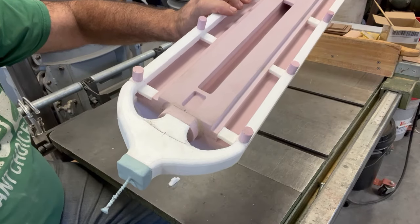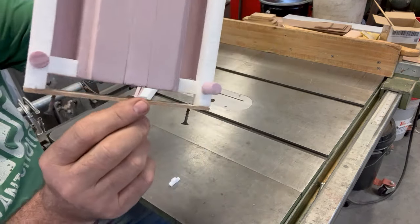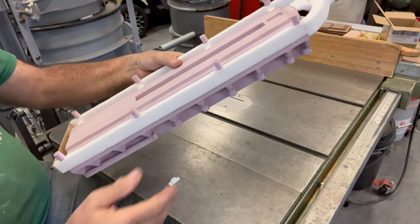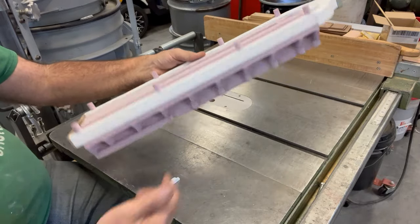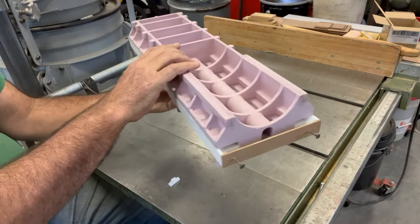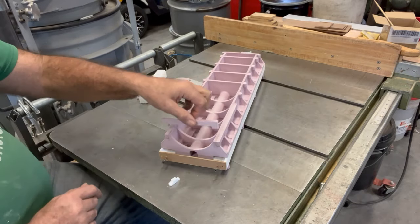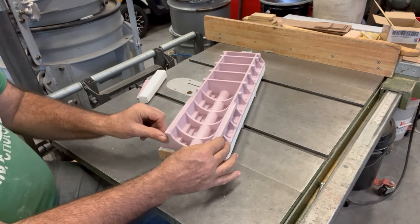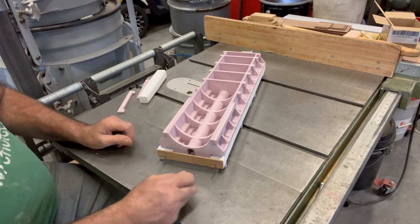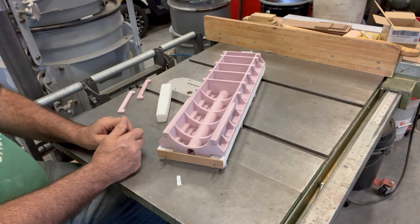I glued on a little chunk of basinite down here with a couple screws, because my plan is to hang this thing after I dip it above my vat at an angle, supported at both ends, and let all the slurry drip out of all the webs for about an hour, then wrestle it onto a flat surface and let it dry. I was going to add a little brace across the top, but it stiffened up so much when I tied that bottom end together I don't think it's needed. I've got a tapered sprue ready for it — next time we'll be talking about a casting.